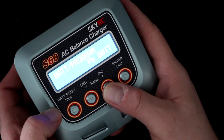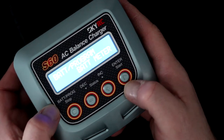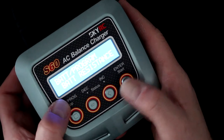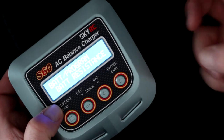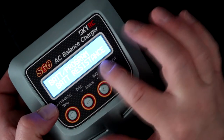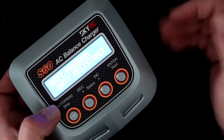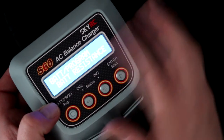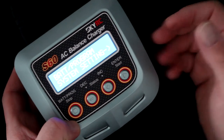In the battery program menu you have: LiPo, LiFe, Li-ion, LiHV, NiMH, NiCAD, and PB battery options. There's also a battery meter, which gives you a reading of what's happening with your battery. Pressing again brings up battery resistance — this calculates the internal resistance of your battery. A lot of quad pilots use this to determine remaining battery life and how much run time they can expect.